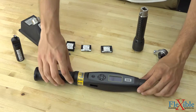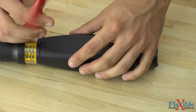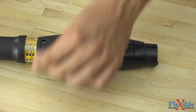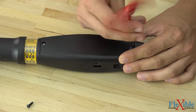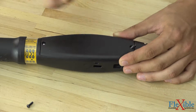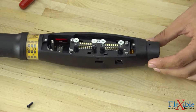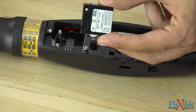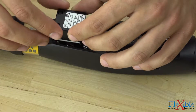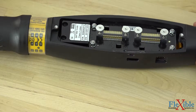Let's start by assembling the controller. Using a 2mm allen key we can remove the two screws on the rear of the controller and remove the back plate. We now see three positions to add in our modules and RBU. I'll start first with the barcode scanner — line up the holes on the barcode scanner with the screw posts and gently seat the module into position. Be careful not to touch the electrical contacts on the rear. Once seated, use a 2.5mm allen key to screw it down until the module is snug in place.